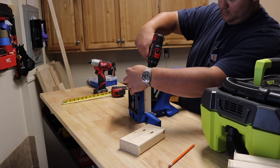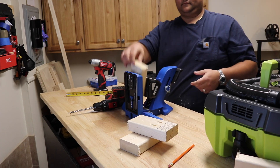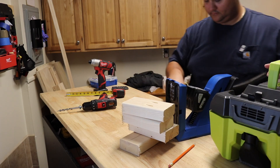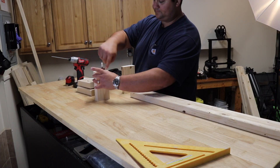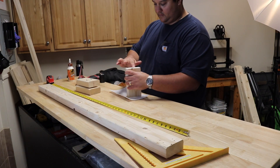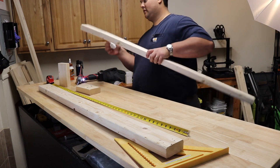I played with it the first night — tried moving the studs a half inch here, half inch there. It didn't work. So I came back upstairs and decided to cut new pieces and just do it the right way. Somehow — I don't know if I was tired — the new pieces were even shorter than the originals. So I said, I need to go to bed and think about this. Unfortunately I didn't have any new eight-footers and it was snowing, so I wasn't going to drive to Home Depot. Instead, because this is not a structural wall, I drilled some pocket holes, added wood glue, and made the right-size board using the materials I had available.